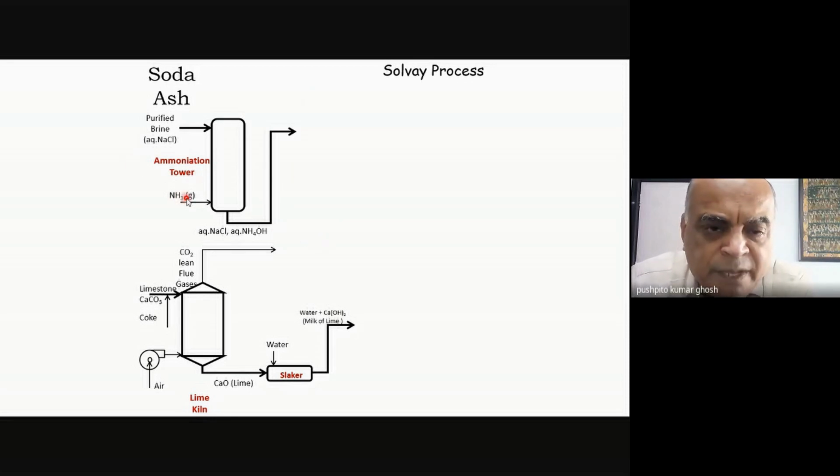But the problem is, you see, ammonia has relatively high solubility in brine. So I can feed it in. Whereas CO2 has extremely limited solubility in brine. So I really cannot put the CO2 unless I have a high pressure, which I am exerting. Otherwise, you've got such a limited solubility of CO2 that the reverse sequence would never be useful.